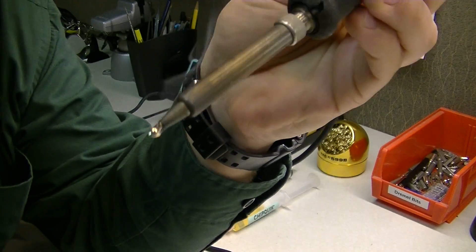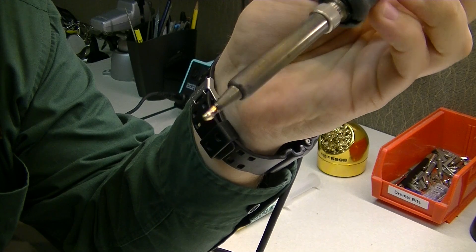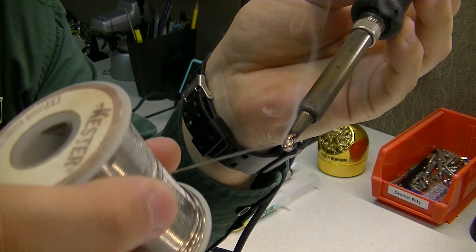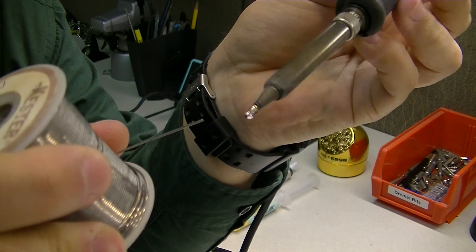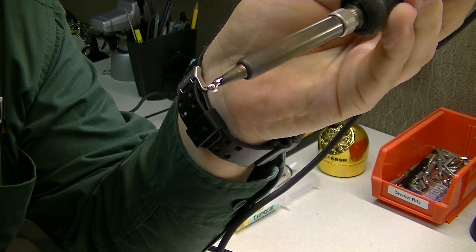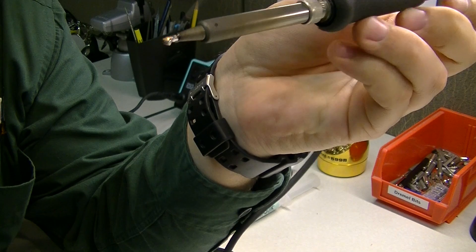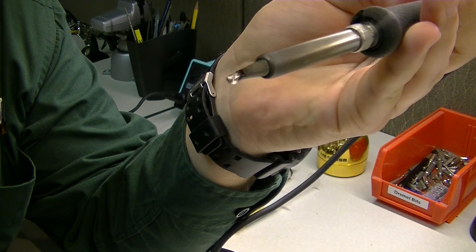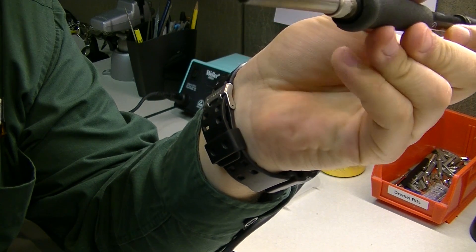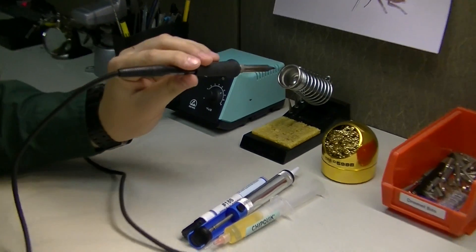While the solder is on there, we're going to turn the iron off. As the iron cools down, we're going to use that to our advantage — when solder is too warm it will just pool away and possibly drip on the work area. We want to get solder into every nook and cranny of the tip, so while it's cooling it's still warm enough to melt solder but won't drip away. You can also twist your wrist to get solder into all the different areas. Once you feel you've applied the appropriate amount of solder and it's reached all the critical areas, you can then carefully put it away.